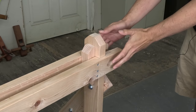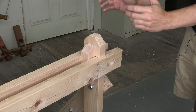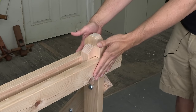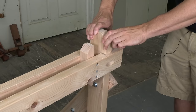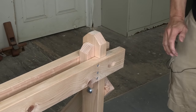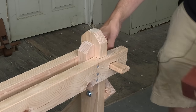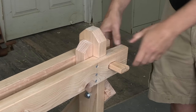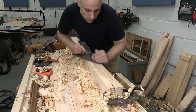A spring pole lathe is pretty big, and it can take up a lot of space in a small shop. You might need a lathe that you can take apart and store when you're not using it, so this is a knockdown design. I made the bed out of two pieces because that's really rigid and strong, and these two pieces are notched into the upright of the leg and just slide on. Then, to lock everything in place, I have an angled mortise and a hardwood wedge. I tighten the wedge with two taps, and everything is held together super strong and sturdy, and the whole thing comes apart in seconds.